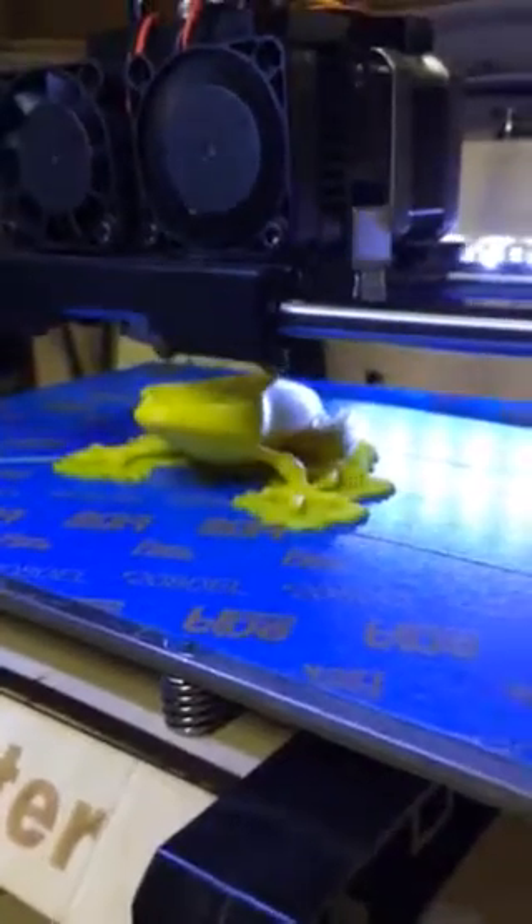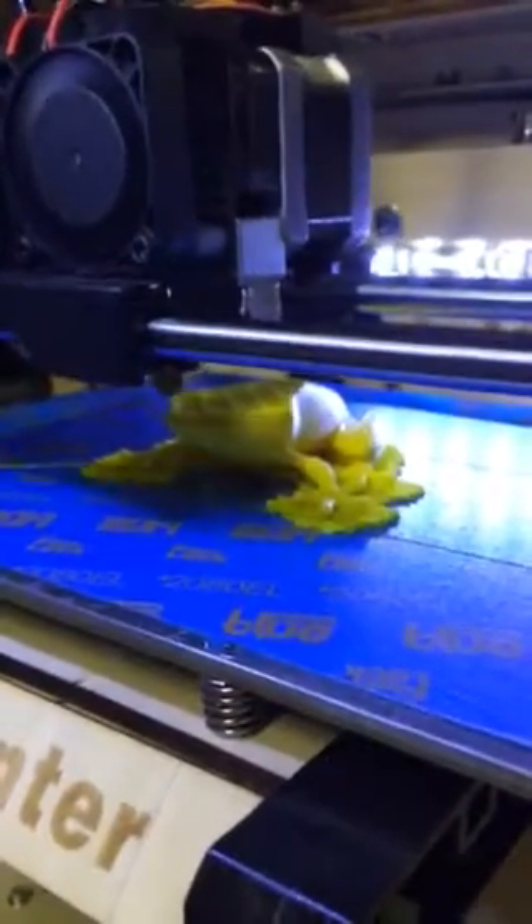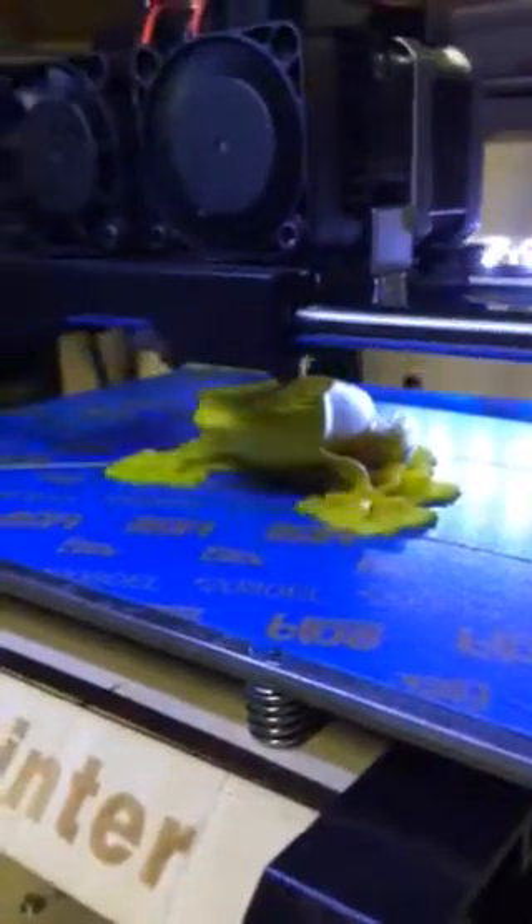This is a CTC 3D printer bought off eBay, and I actually got both of the extruders working. I wanted to rerun something that ran really good to make sure after I leveled the right side. I actually shimmed it — as you can see right down there, that's tinfoil.